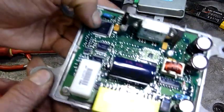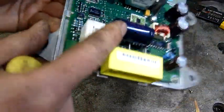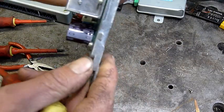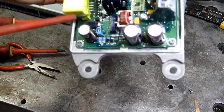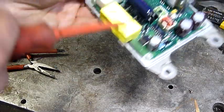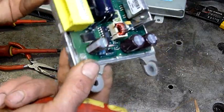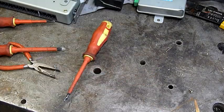It's got a light conformal coating on it. There's a 2200 microfarad 35-volt cap - nice quality ones too. Nippon Chemicon 35-volt 560 microfarad, and a Nichicon 1000 microfarad 35-volt. This would send pulses - the yellow plugs in the system are all connected to airbags. So this would also send pulses of energy to the airbags themselves and fire them. This is the main deal - this fires the airbags off. Let's grab a Torx driver and try and open this up.